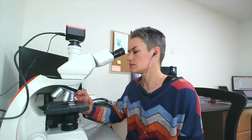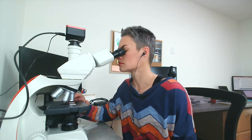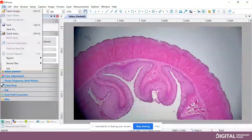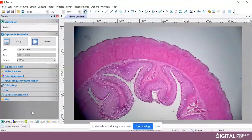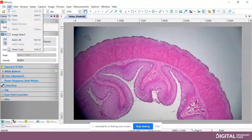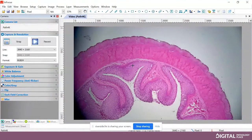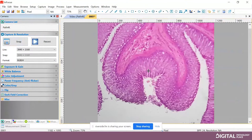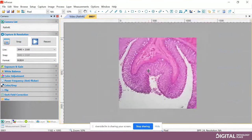You can basically center what you're interested in. Go to Edit, then Image Select, draw an area of interest, and hit Snap. It only captured that area. You can zoom in — hold control and scroll with the mouse wheel. When you do Image Select, you do shrink your size, and when you blow it up you do get some pixelization at some point. The proper way is to use the proper C-mount to eliminate that. Alex, we can ship you a 0.7x C-mount and we can redo this next week if you prefer.